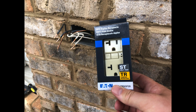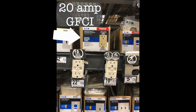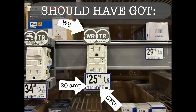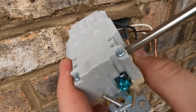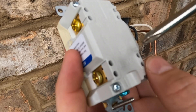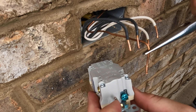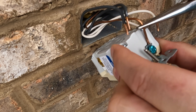Here's the new one that I'll be installing. While researching which GFCI to get, I knew I needed a 20 amp in case I wanted to use power tools on it. But one thing that I missed was weather resistant, which is flagged with a WR. Those are made of different metals and plastics, which allows it to last longer outside in the elements. I realized this when I was unboxing the new one, but figured with it being on a covered porch and with a new cover, it shouldn't be that big of a deal. But if you're doing this, make sure you get the right one, which would have a WR on it for weather resistant.